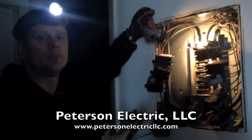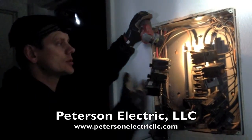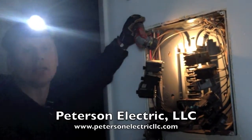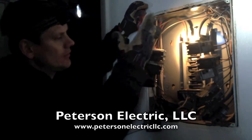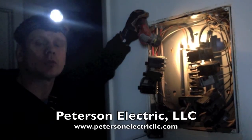What we're going to do is take this panel out and try to sand it down. If we can get that nice smooth silver look again, we'll put it right back in and it should be just fine — the breaker isn't even melted. The first thing to go on these panels is always the plastic, but as you can see, not a single piece of plastic is melted. So it's premature. Anyway guys, thanks for joining us, we'll see you next week.